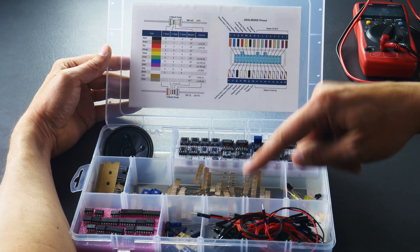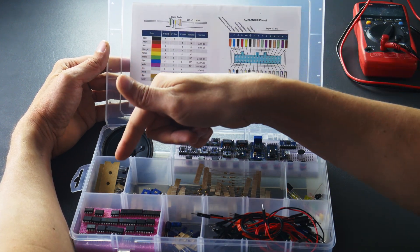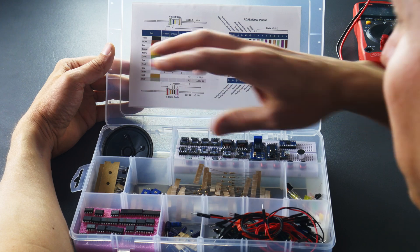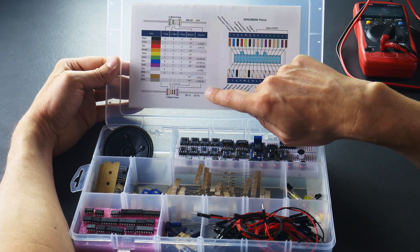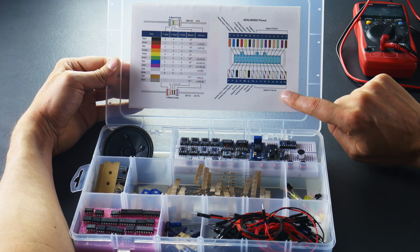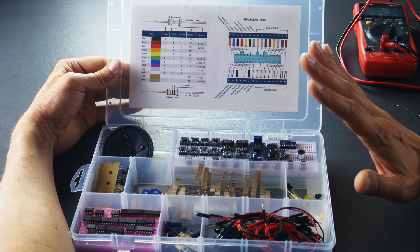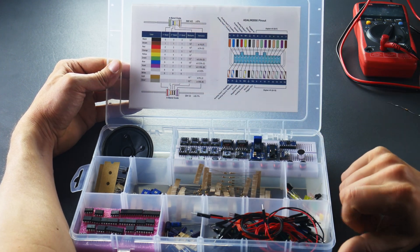You've also got your diodes and your LEDs along with some connectors, a speaker. But it also has other stuff like phototransistors that detect light. You also have some LDOs, which are things that will regulate your voltage. And then you have a lot of other things like op amps, which we'll get into later, as well as comparators and just a bunch of other different things that you will find very useful. They also have this up here for your band code — I don't memorize that stuff because I'm slightly colorblind. But this reference is actually very helpful with the Discovery 3 because it shows which pin goes to what, including the color and what is going to be written on the very end piece. So I reference this a lot when I'm working with the Discovery 3.